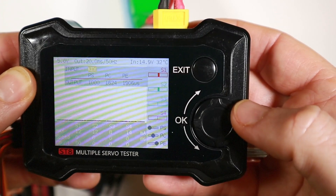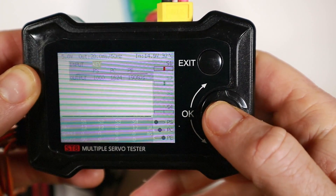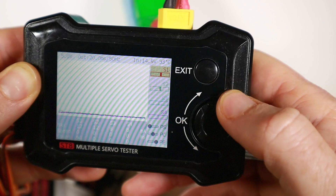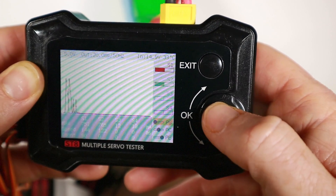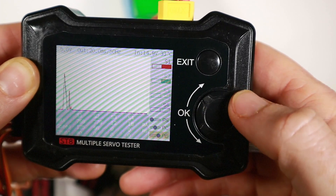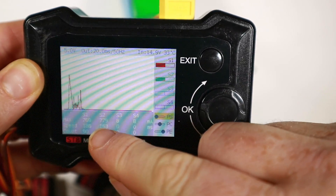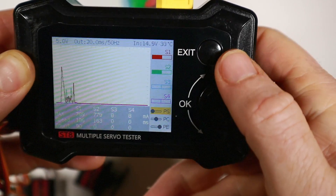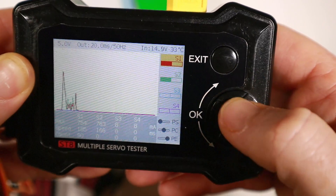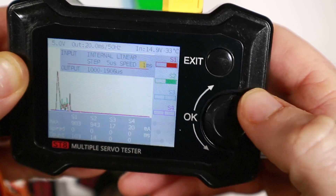Another mode is Key, which is quite interesting because it allows you to measure very accurately the time between three points. I'll pop it back to 1500 as the midpoint, then I can press the button to go to each of those points independently and give myself a timing. Going all the way back from PE to PS, for example, gives the speed it took and the amount of milliamps — and I notice a slight difference between servo one and servo two, even though they're the same brand.